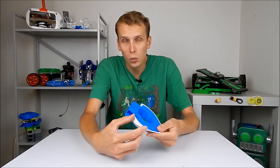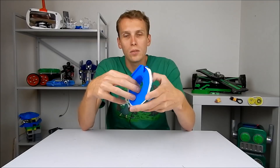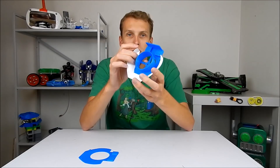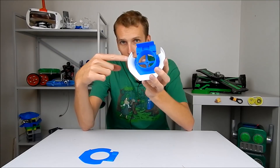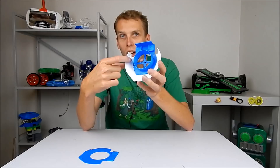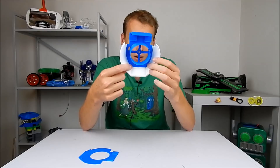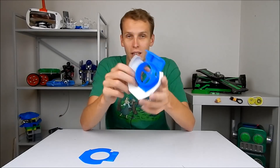There is now a proper base plate in here. This base plate is literally so that the TPU gets pushed and held outwards at the walls, which means it can't flex too far — it hits that barrier and stops. Whereas if we take that off, the TPU can flex all the way in until it touches the fan, which is not good because a significant weapon hit on this side would do concussive damage to any electronics sitting in this well. And we need to sit electronics in these wells because there is nowhere else for them to go in this chassis.